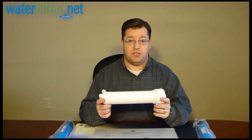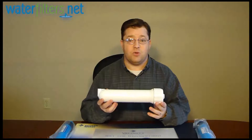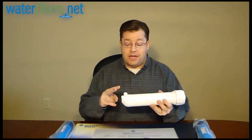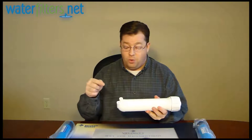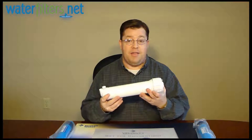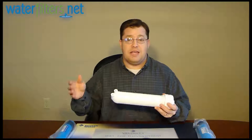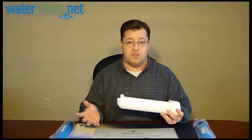There are several others that will also fit inside this membrane housing that are industry standard size. So if you're having difficulty finding the correct membrane for your system, don't worry about it. Buy a new membrane housing — they're not that expensive and they're very easy to install. It's going to be just like what you have right now: one inlet on one end and two outlets on the other. Then buy an industry standard membrane that you can replace very easily going forward, because everybody's making them this size now.